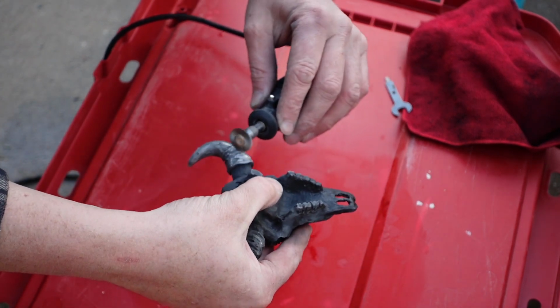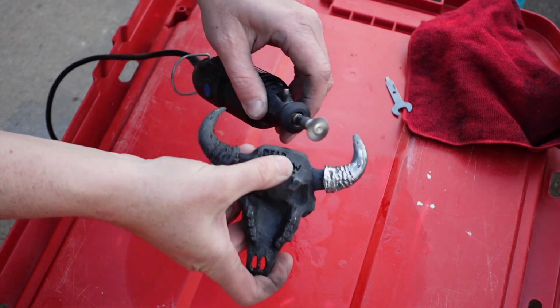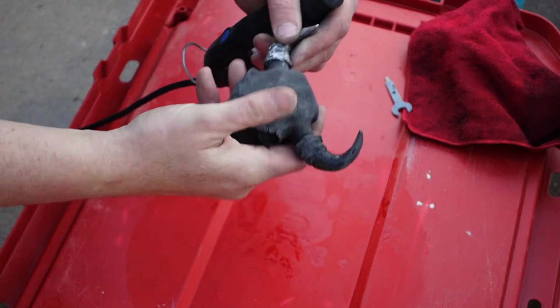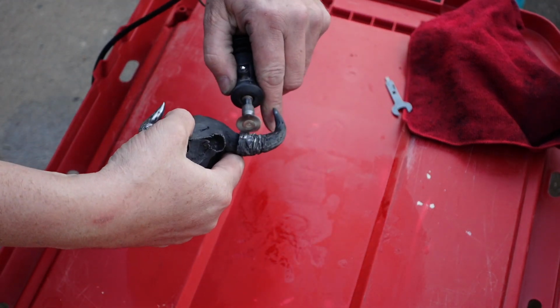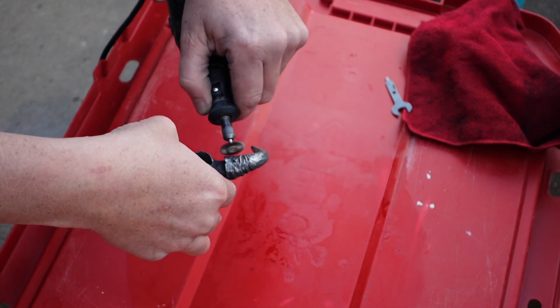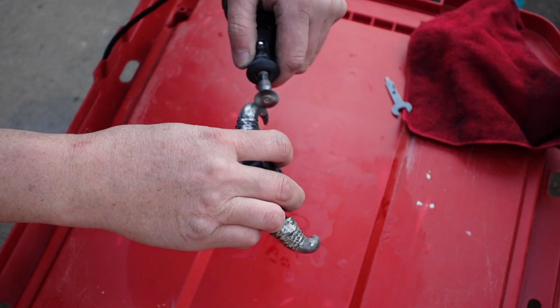So it works really well. And when you dip this in acid, you do want to wash the acid off before we continue on the process, as it will continue to darken a lot if you don't get that acid off there. It'll keep reacting. So where you're buffing it out, it'll continue to darken if you don't get that acid off. So just a little note there.